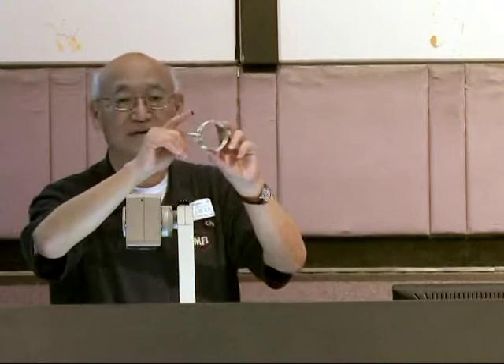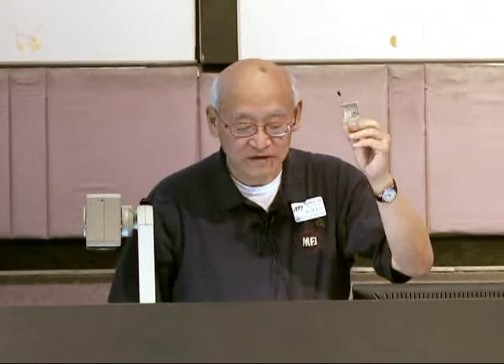What I want to do next is take a tuned circuit. We're going to make some measurements with tuned circuits. A tuned circuit is a coil either in series with a capacitor or in parallel with a capacitor — a parallel resonant circuit or a series resonant circuit. What we're going to do first is find the series resonant frequency of a series tuned circuit.